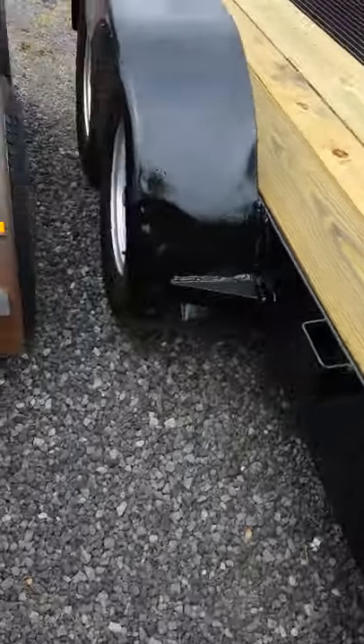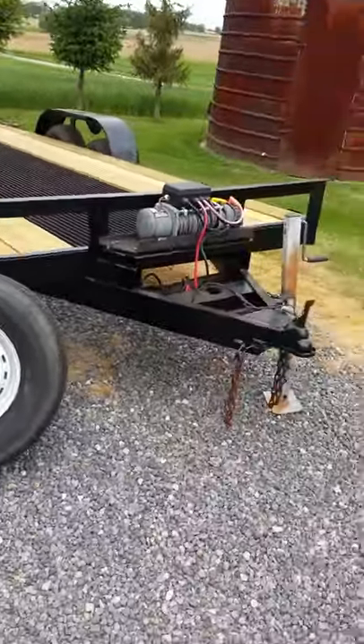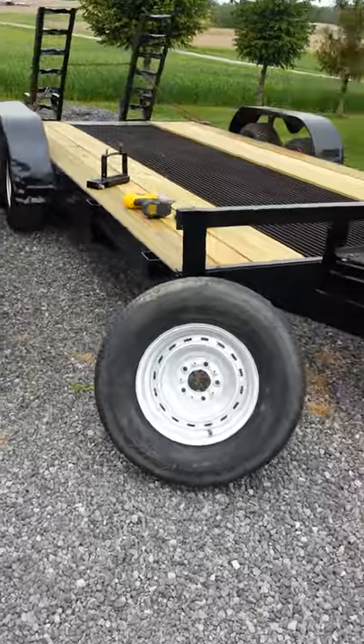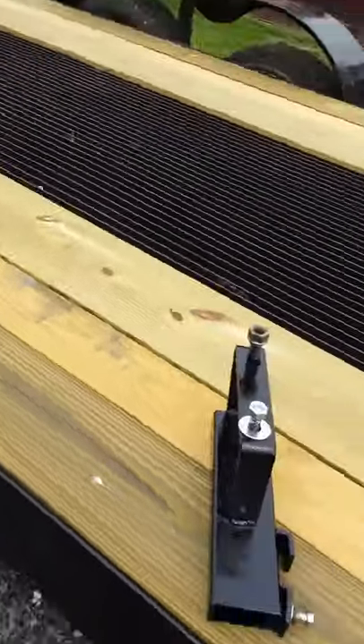It's pretty important to carry a spare tire with you when you have a trailer. Trailers just seem to be much more prone to developing flats and blowouts than the vehicle towing the trailer itself. There is probably an explanation in that the trailer tires they make — generally the Carlisles and stuff — a lot of them are made in China. They're made for trailer only, so they're just for rolling, not for propulsion, and I think they're quite a bit lighter duty in that sense.